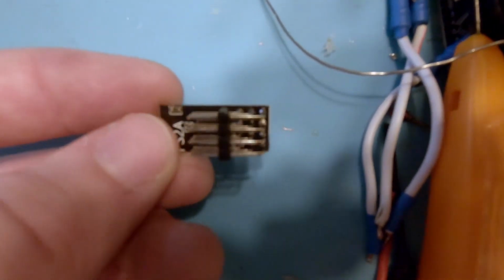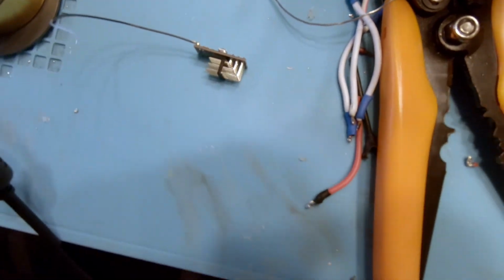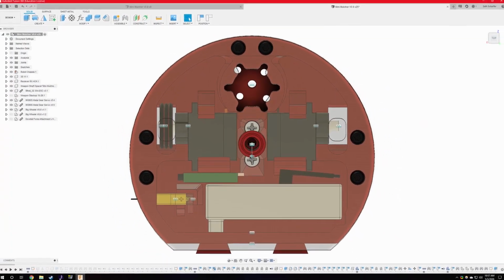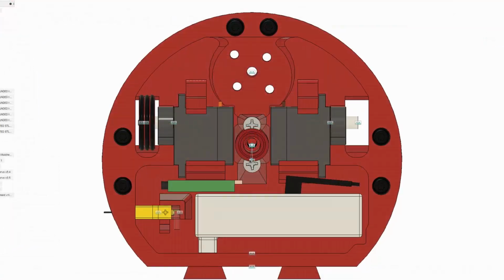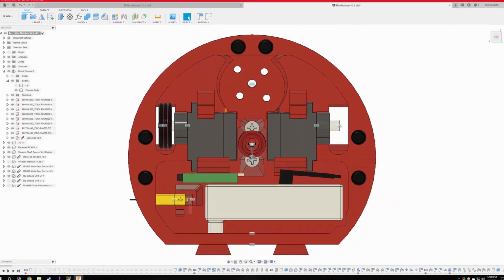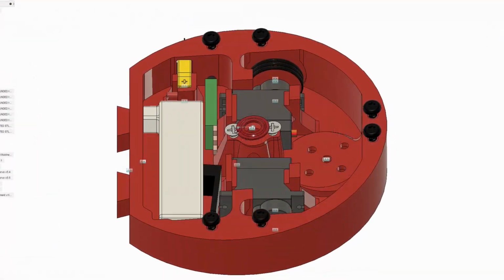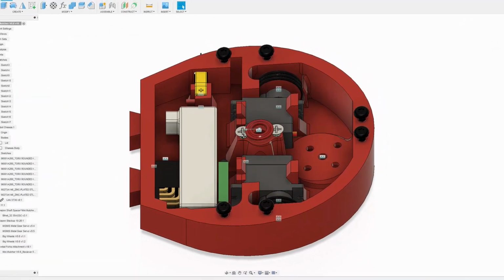So Friday I soldered one together, quickly realized I had a few issues actually fitting it inside the robot, and then went back into CAD, splitting off version 0.6 into a version 0.8. I added extra room at the front as well as behind, cutting out some material that was in the way of the wires, and I added little protrusions behind the wheels to prevent wires from getting caught in them. I remodeled the receiver to make sure it would fit this time as well. All of this was Friday night, and after 7 print hours, I had a brand new PLA chassis and lid